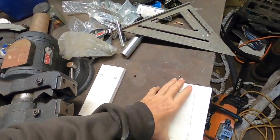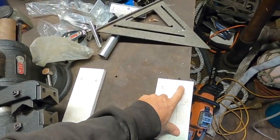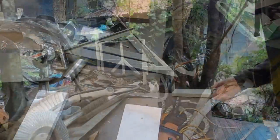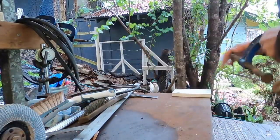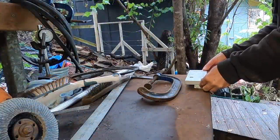There was a fair bit of discussion last week about adding a third roller to the bowsprit to stop the chain hitting or cutting it back. I think the compelling argument for adding something extra — an extra roller over cutting it — is that when you're deploying it the chain will go slack and it's likely to hit anyway, not so much pulling it back in but definitely heading out. The thing that maybe isn't that obvious on film is how low profile that stainless bowsprit is by the time you get to the aft end of it, which means there's not a lot of room to put a roller.